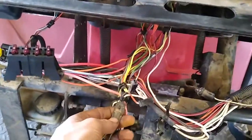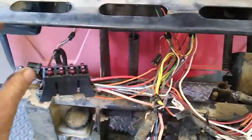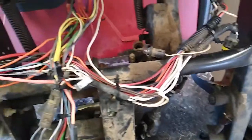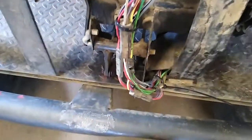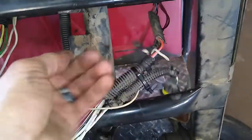and I was also taking all the connectors apart, cleaning them out inside the fuse box, took all the fuses out, cleaned it out inside, unplugged all the headlights. I would disconnect something and then turn the key to see if it was still blowing, and then I would plug it back in. I saw some cut wires. I thought maybe these were arcing.